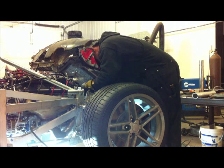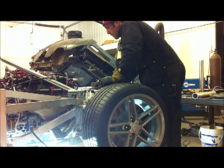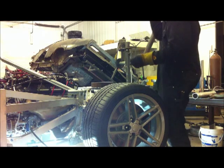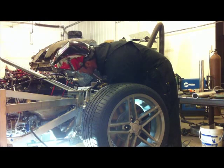So with that being said, the exhaust clamp is in place. Everything is fitted. Everything is taped. I have the final tacking to do. I like to get 3 tacks on every joint, if I can. I'm just double checking clearance by the muffler here. There's a couple sets close to it. You can do more, but you need at least 2 though.